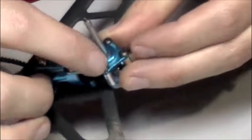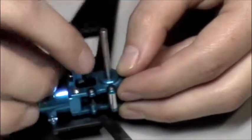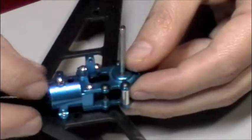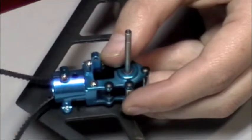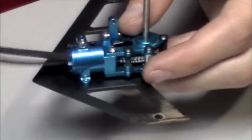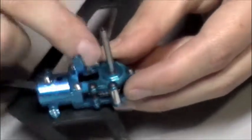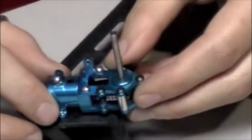So I picked out the best bolts that were around, and I put it all back together again. I haven't tightened it a whole lot, which could be good. Probably it doesn't need to be super tight, but it runs a lot smoother. Like, I can pull that belt through there and it's really smooth, which is what I want. So I think I will go back again, take all of those out and put Loctite on them, because I think this is my final setup with that tail.